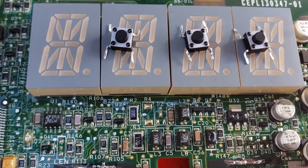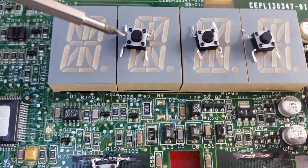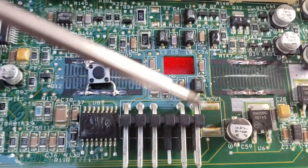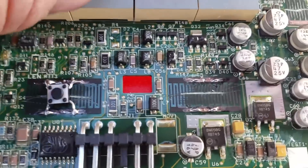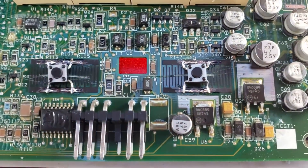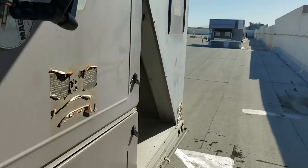I take these micro switches and reorientate the little feet — the pins — so they're oriented correctly. This one went straight through and it's one wire, and this one's one wire. So I bend them so that the two feet are going to go up to the one contact here, and then the other bottom two feet are going to go to this one. You just kind of lay them down in there, soldering them on something like that. That way when I push the button, it's just shorting those two pads.